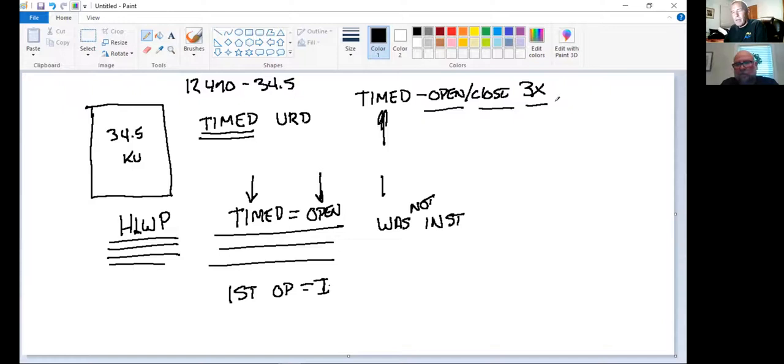It's essential to know what kind of scheme is running on your system. Ask your company, your crew, your supervisor — are you running a fuse saving or a fuse blowing scheme? What is your procedure for closing switches on new or repaired equipment? Know that information ahead of time — it's a safety requirement and it'll save you a lot of headache on outages.